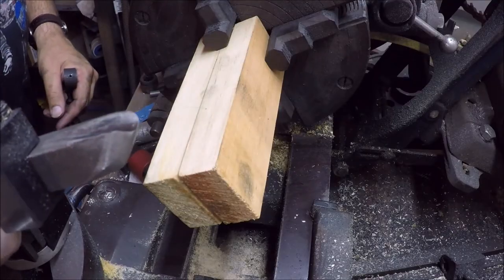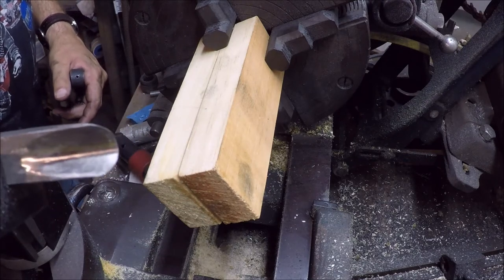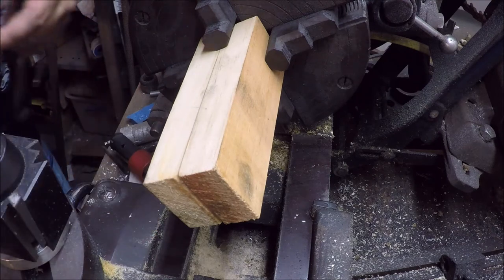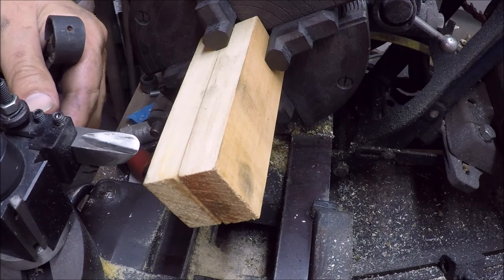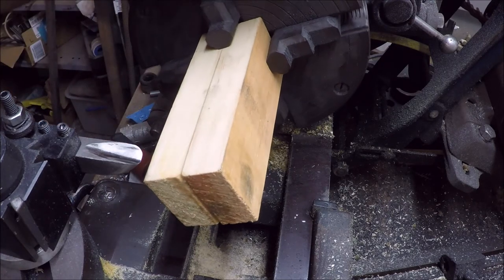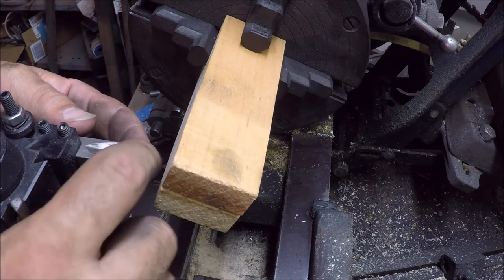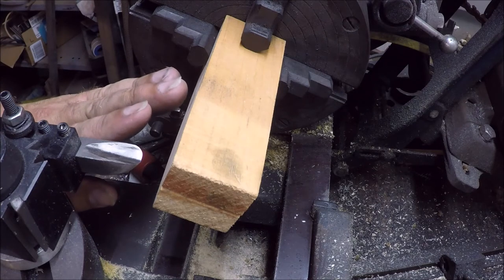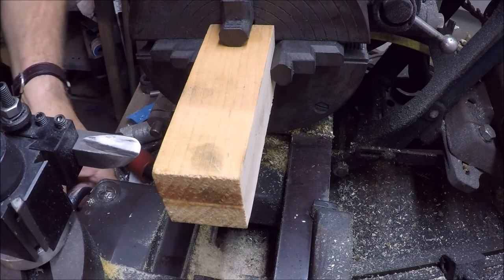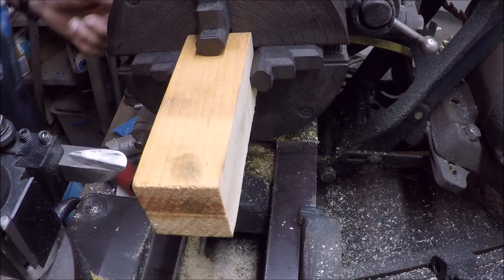We're going to be doing some wood turning. This tool came with some turning tools I found probably on eBay - it's a little turning gouge made out of a piece of high-speed steel. I was doing some practice cuts a few days ago and I think having it on center isn't actually going to work so great because it's kind of just scraping. They're supposed to be angled in with a pretty positive attack, so I'm going to try raising it up high to give a more positive attack at the wood as it comes by.